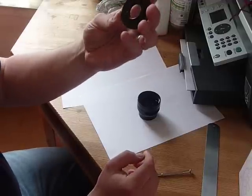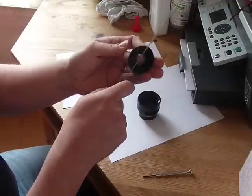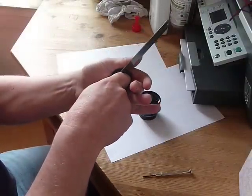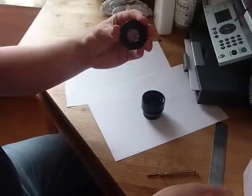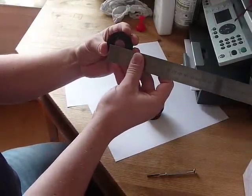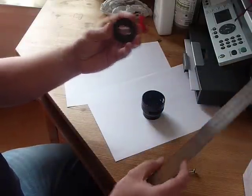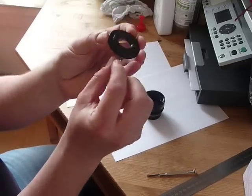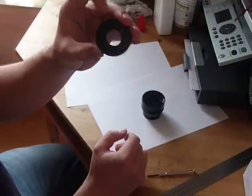So this removes and you've got the collimating lens here. This one will also unscrew - it'll be a bit tight, should really clamp it down, but that will also unscrew and releases that lens there. The lens itself, when you remove it from the cell, is 25.4 millimeters - bang on an inch. A very interesting feature is the threads and the diameter here is M48.